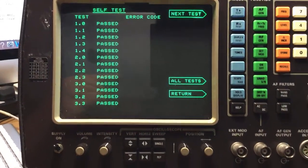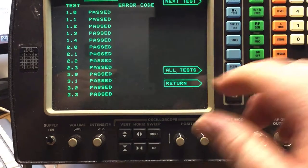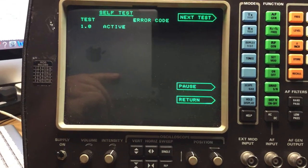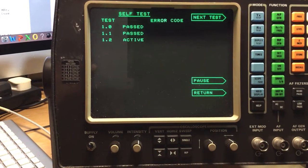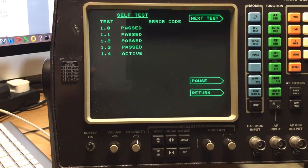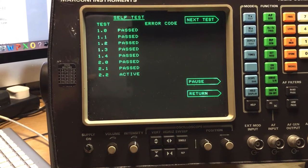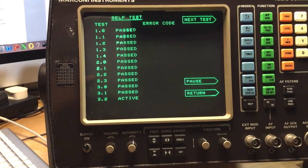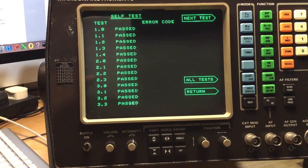We're back after doing some more measurements. Running the self-tests now — all tests pass. The repair seems to have worked. Regarding the 200 MHz oscillator setting in the manual, I couldn't find anything specific beyond measuring the frequency at the particular point and adjusting the tuning capacitor. Quite interesting — I'll look at some of the theory and description in the manual for further detail.